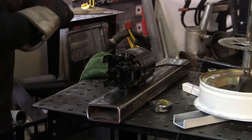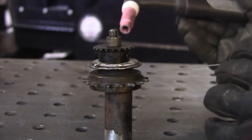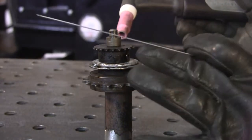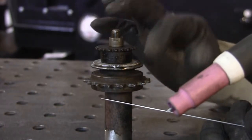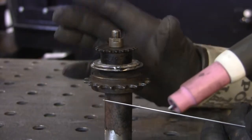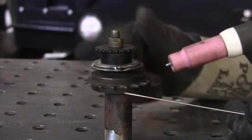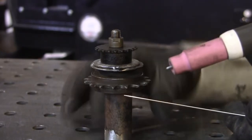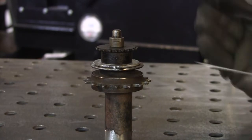Let's weld that up right now. Here are our little sprockets — I'm going to be running a bead right in through here and we're nice and centered. You don't want to always go all the way around in one fell swoop because there's a bearing in there — you want to keep it moving around, jump around with your heat a little bit. Cool it down if you need to with a little rag with some water. I also tried to clean as much grease out of it as I could. I made a little sleeve right here on the table to keep it from falling over.